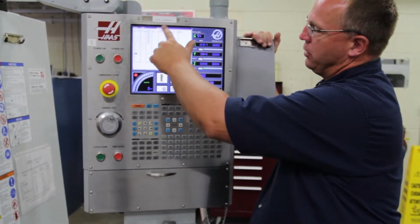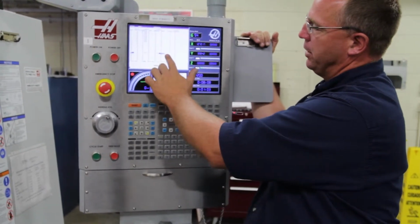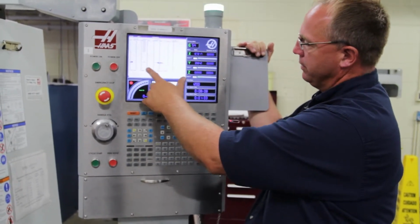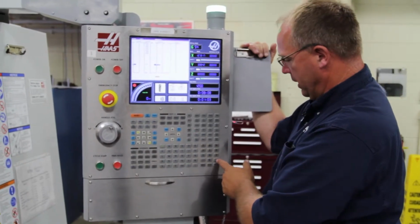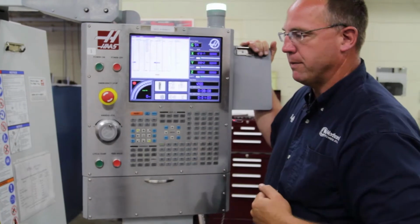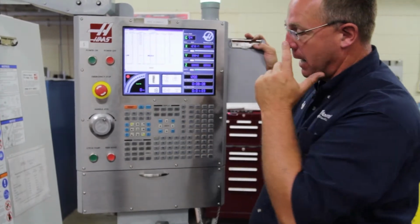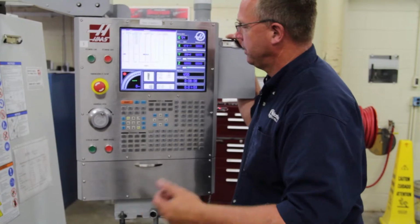In the wear page, you can do it in the diameter, because remember, when in the program, when it looks up this number, it'll add these two numbers together. So in this case, it would say 0.6354. It would be the same way doing it this way, 0.6354. So when the machine in your program calls up this number, it's going to look for that length and that diameter. So that's our end mill measured, and now we want to measure a drill.